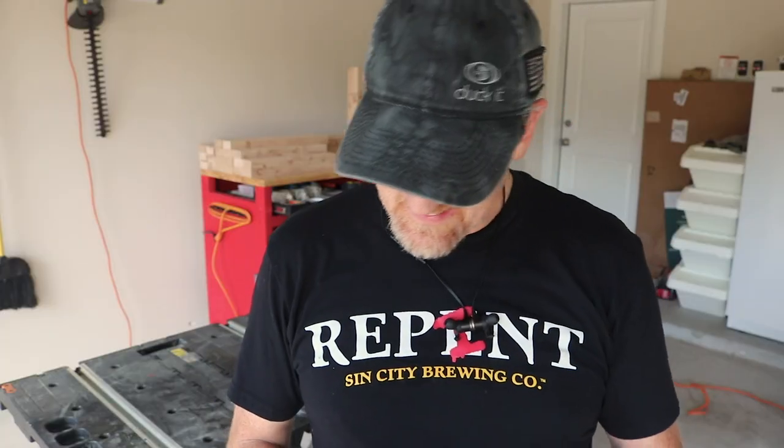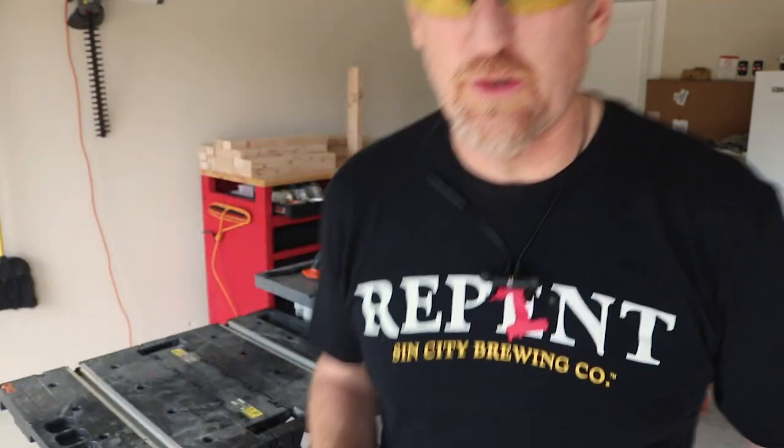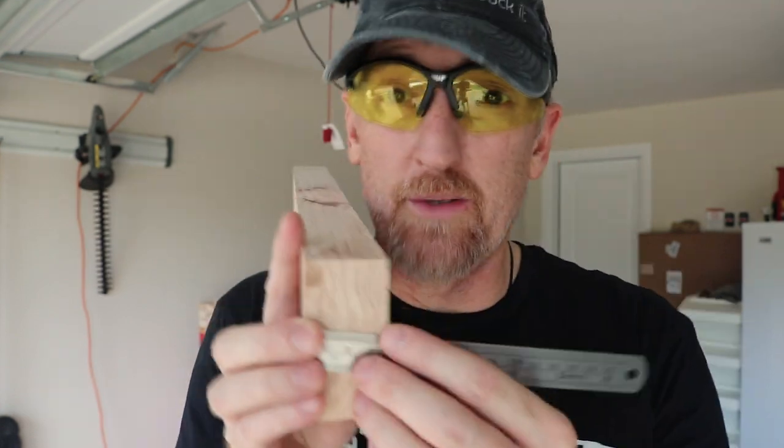It's actually Father's Day today, so happy Father's Day to me and all you dads. So what is half of one and three-eighths? Eleven-sixteenths. Here's what we're doing: we're sawing two by fours in half. A two by four is actually one and a half inches wide standing upright. You'd think you just halve it to three-quarters, but you've got to take into consideration the width of the blade — approximately one-eighth inch — so you subtract that first and then halve your number. Eleven-sixteenths. I had to ask my wife what the answer was.